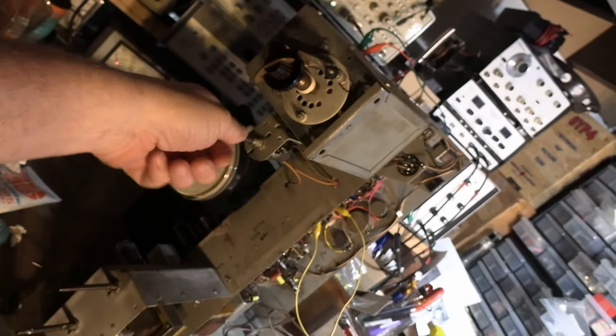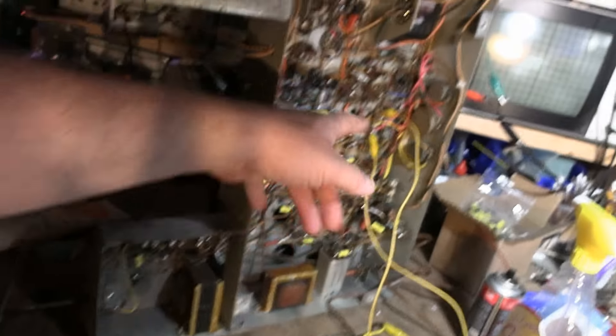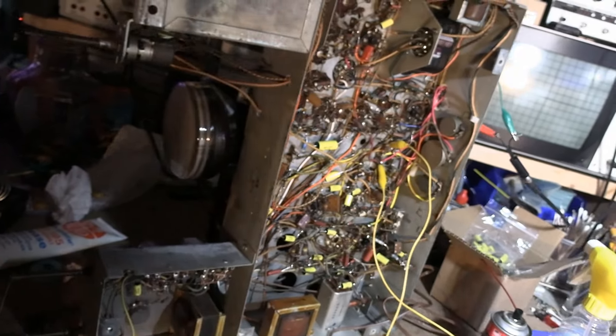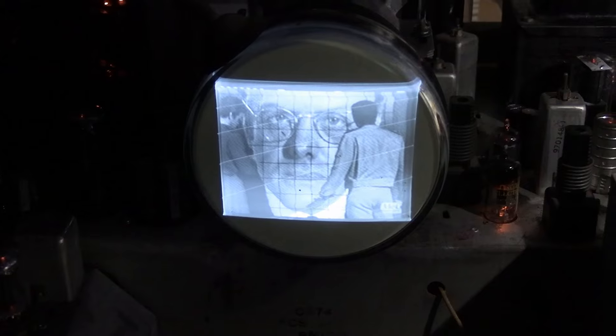Alright, are we ready? Here we go. I've done this so many times I could do it without consulting the schematic. Yes! We've got our square back. Do we have any reception? Yeah — it's working quite well. I'm still using the little bench test CRT, so it's definitely working in terms of the power supply. But to make sure it's working in terms of its focusing capability, I need to install the full-size CRT — so we'll try that next.